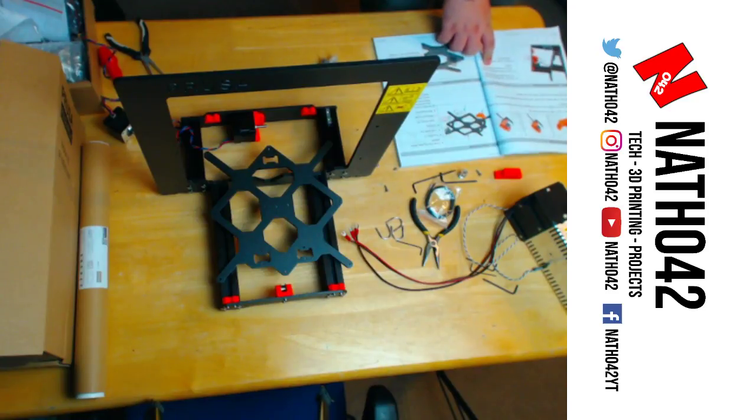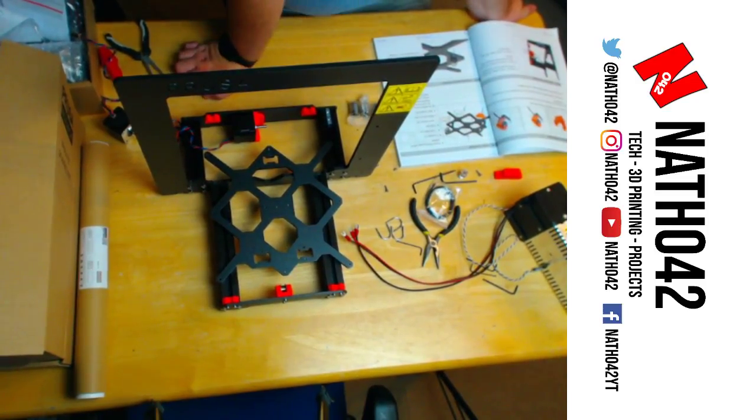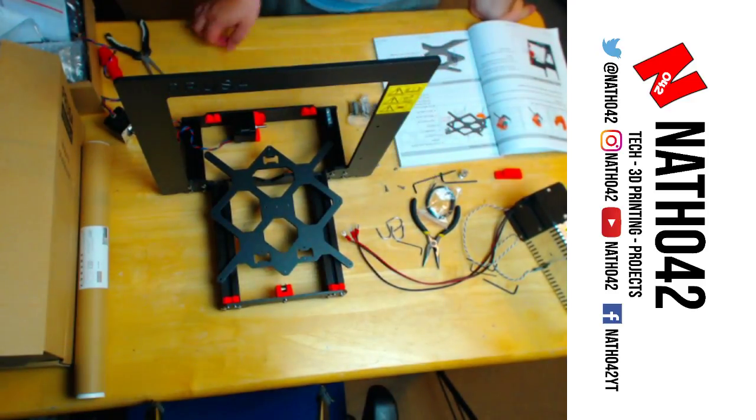Take the Y motor holder and place it on the rear plate, short extrusions. Ensure correct orientation, the motor shaft. Yep, I've done that. Sorry. For the following steps, prepare the Y carriage, the Y belt holder, the U bolt, the linear bearings. Yep. The nylock nut, I need 6 of them. I have 3, 4, 5, 6. Yep. And 2 normal nuts. Oh no, sorry, 2 10 mil screws. Yep, I have all that here. That's great.